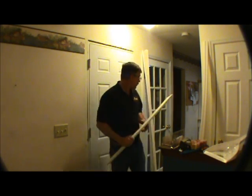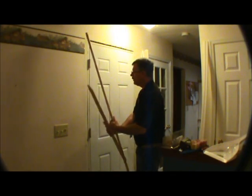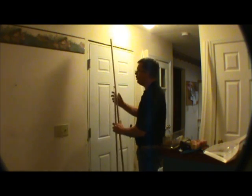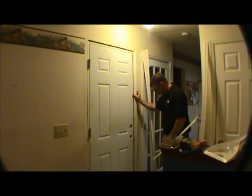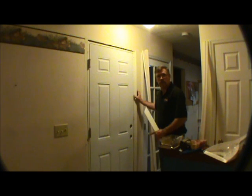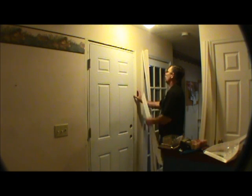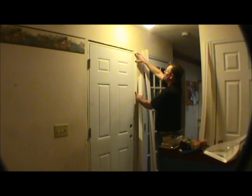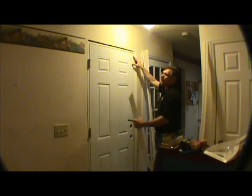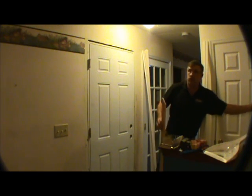So what I did was I took one of the original trim boards that we had, and I had this side, which is the side actually cut for my new piece here. But for this side, I wanted to match our base trim down at the bottom. And our door opening actually did not go much any larger width-wise on that. So what I want to do is match that trim at the bottom and then try to match what meets the wall here. And then I knew that I was covered up here and I'd blend in. So that was my mark there on that side, and then I did the same on that side. So that's how I determined how long this board needed to be from that point.